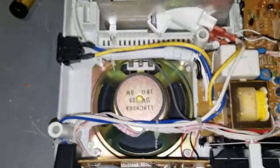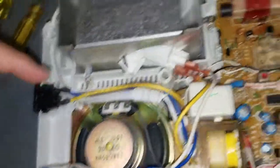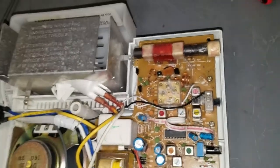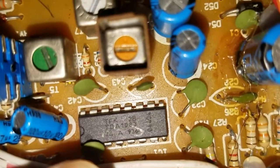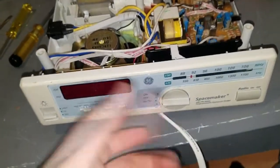Look at the size of that speaker — 16 ohms, 3 watts. They weren't messing around. Under there I assume is the relay for the appliance outlet. There's your AM antenna; the power cord probably serves as the FM antenna. One chip says 936, so that might be 1999. Another says 9V7. The light bulb has an underscored 9 on the edge, which for these old GE incandescent bulbs usually indicates the year. So 1999 for this thing — I'm confident in saying that.